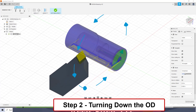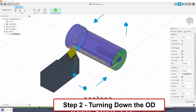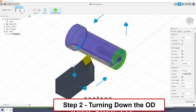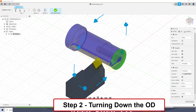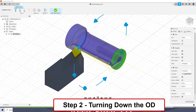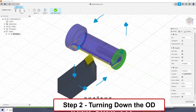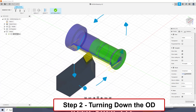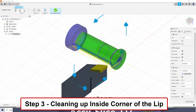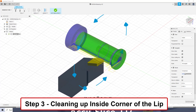I use that same tool to turn down the OD of this piece. The overall diameter of the main body is 0.4997, but I have a small lip at the front which is a little bit larger. Now this tool can't do a square corner on that lip, so in the next step I'll change the tool to clean up that corner on that front lip. This uses multiple steps to cut the piece down to the final dimensions. Step three, I change the tool to clean up that lip to give me a nice square corner on the front lip.